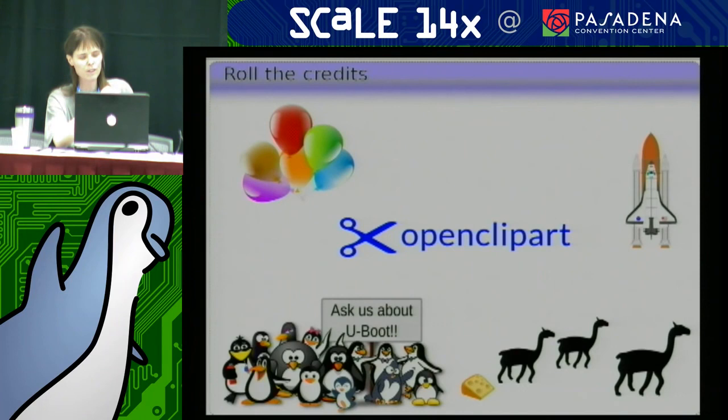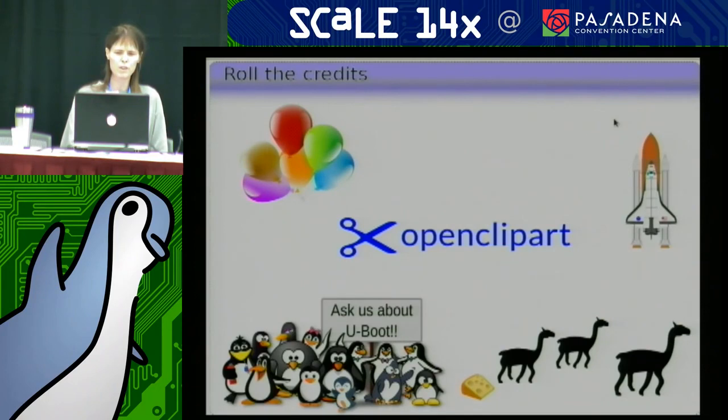You would use a different U-Boot — not the same one the software engineers used during development. I think they called it Falcon mode. Essentially what they did is make it so the secondary program loader mode, where you compile it down with just a tiny minimum of stuff, is smart enough to load your kernel directly without going through the full U-Boot. You compile in just what you need into the tiny one and it doesn't know how to do any netboot nonsense, memory tests, etc. It just knows how to get the kernel from, say, SD or whatever you've got and run it. I think that might actually have been Wolfgang who did that project. You can look for U-Boot Falcon — I'm pretty sure that was the name.